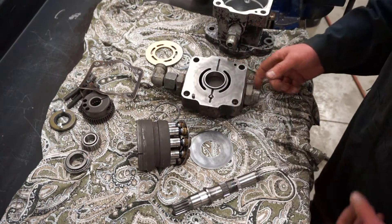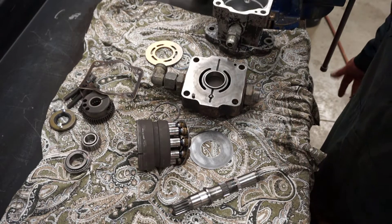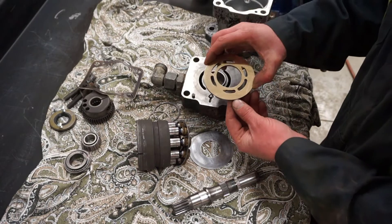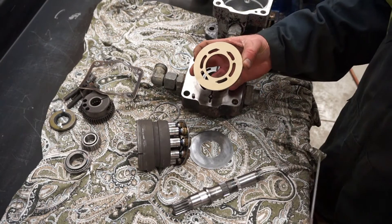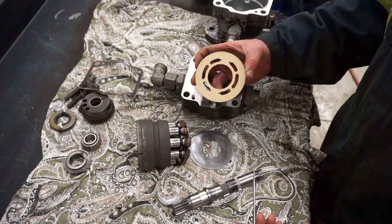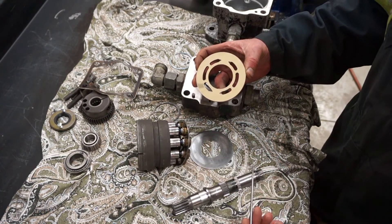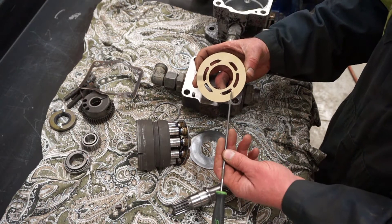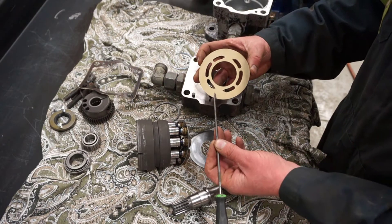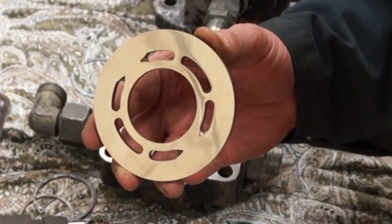There's really no difference between an axial piston pump and an axial piston motor — basically the same parts inside — other than a few things like the A and B port and the valve plate. This valve plate has armored webbing on both sides of the valve port, which tells me it's designed to hold pressure on either side. The fish tails point in the direction of rotation, and with four pointing in different directions, this unit is meant to spin clockwise or counterclockwise.